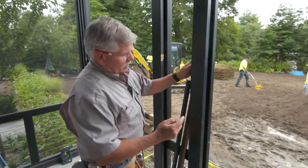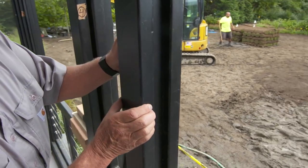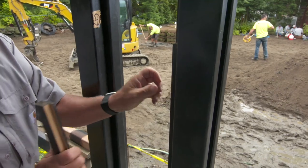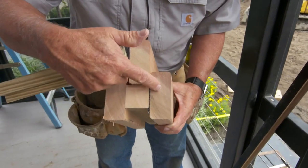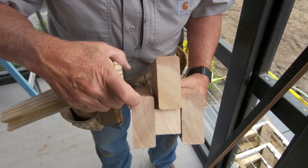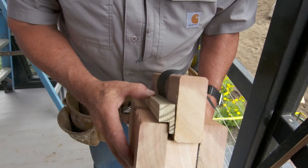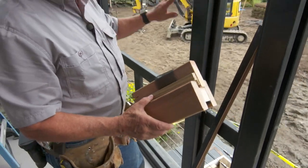It's pretty cool the way Jeff framed this. What we have is a 2x4, an inch and three-quarter filler, and another 2x4. On this side you can see a 2x4 sticking out which creates a dado for this piece to slide into. Let me show you on a mock-up. Here are the three 2x4s and the inch and three-quarter filler that creates that dado. The piece we're going to attach the screening to will be stapled on the back, then we slide this rabbeted cut into that dado and screw the screens into the stop. That will hold the screens into the opening.